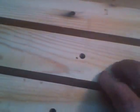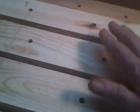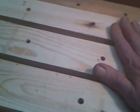I've already run this once and got rid of most of the marks, but there are a few left over so I'll just skim it one more time. This is my spoil board, so these boards are pretty easy to replace. Being three quarters of an inch thick and only having to take off ten or fifteen thousandths maybe once a year, they should last quite some time.